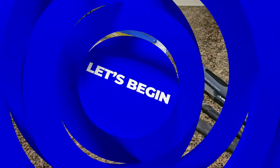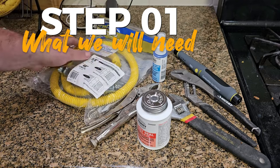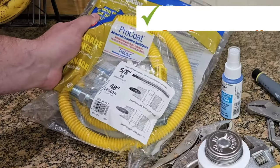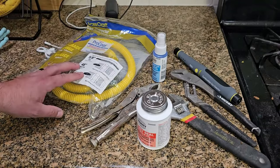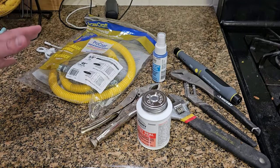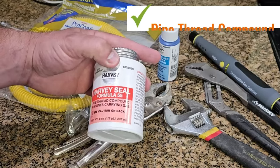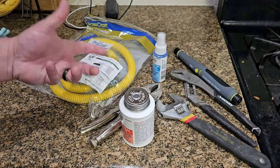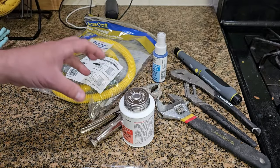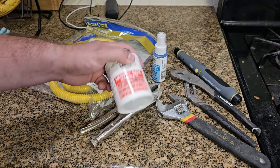All right, so before we get started here, let's talk a little bit about what we're going to need. First thing we're going to need is a gas connector kit here. And usually that's it. You can pick that up at any of your local hardware stores. I'll also link to all this stuff in the description. Some kind of a pipe thread compound for gas lines. They also have Teflon tape that's specifically for gas lines. You can use that if you want. I prefer the compound here.